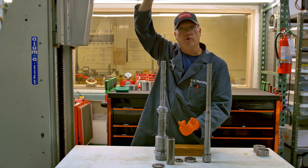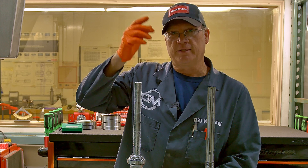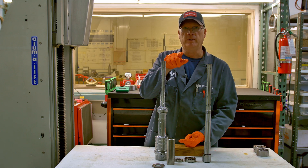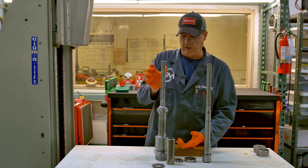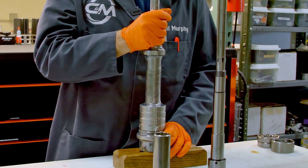If it doesn't drop out easily, then give it a little bit more, but don't get crazy. If it doesn't go past that second bearing, then you've got to get the screw that holds the stop for the down feed — you've got to get that screw out, because somebody's put too long a screw in. The 6206 should slide right out, this whole thing comes right out to you. Let it drop on something wood or foam like that.